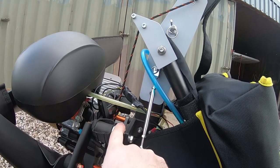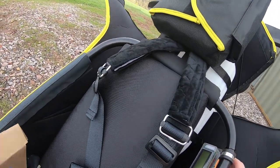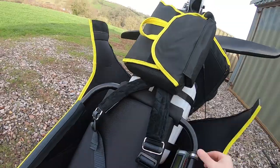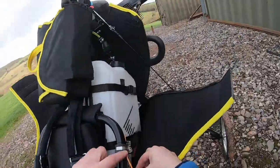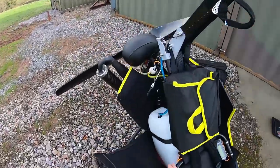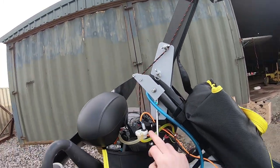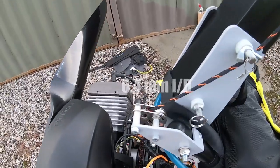I need to make sure I can fit it in accordance with the manual — it needs to be fitted vertically, it can't be fitted upside down. At the moment I'm thinking about fitting it to this part of the frame. I'd rather just show you the finished product. These are the P-clips I've been using with the brackets — mounted on securely with the cabling running through. I've run the cabling underneath and up with the other elements of the wiring looms that go to the engine. This is the fuel flow meter; I've added about 10 inches of the right diameter tubing and tried to make it flow so there are no kinks in it.